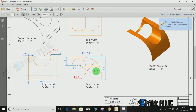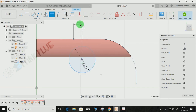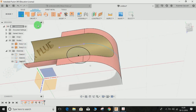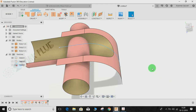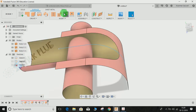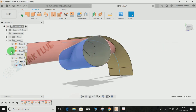The distance from this point to this point is 20mm, and from the front top to this point is 18mm. Press C for circle and draw a circle of diameter 30mm. Press D for dimension: from this point to this point the distance is 20mm, and from this top point to this point the distance is 18mm. Once done, finish the sketch. Click on Extrude and extrude it symmetrically, then press OK. Now I am going to trim this body — select the trim tool, get rid of this part, and press OK. You may hide this body for now.